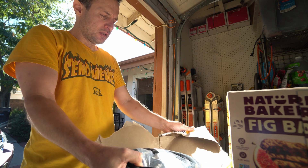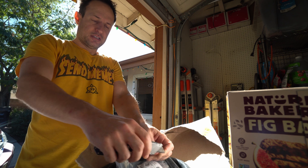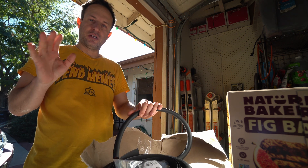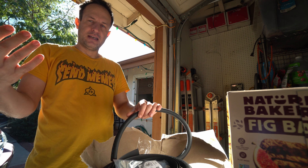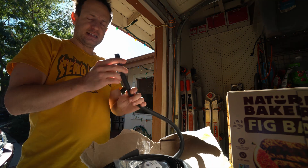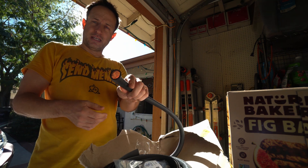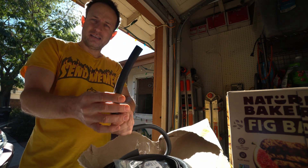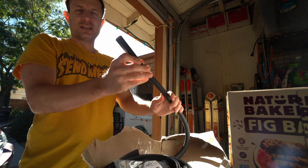I'm taking my time researching, not being in a rush — I've had that luxury, there's no deadline for this. The instructions that Renogy sent me were not as detailed as the online PDF. The online PDF said to use four-zero pure copper, four-zero gauge wire. Look at how thick that is — I wish I had that kind of girth. Thickest wire I've ever worked with.